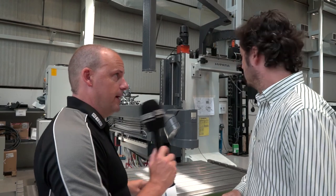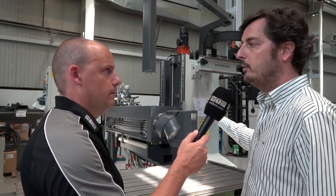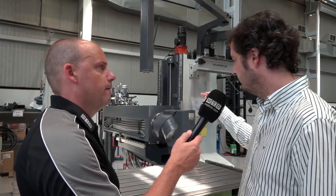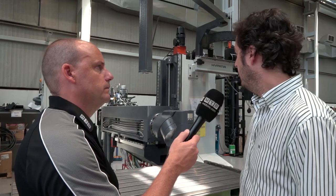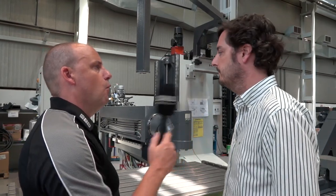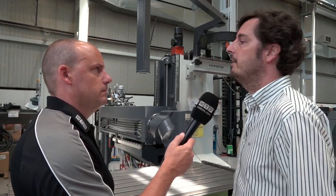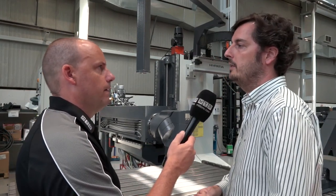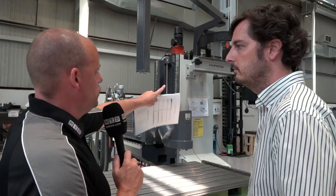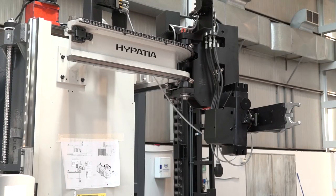This is ISO 50, and the brochure mentions four options on this head. Yes, we have different heads — this is a universal geometry, and we also have orthogonal geometry at 90 degrees, with both rotating axes. And we also have a manual head — very unusual, but we still have that option. What's the most popular of those four? This one — the universal automatic indexing head, the UAD — which is the top-class head in terms of features.